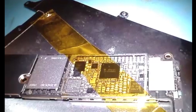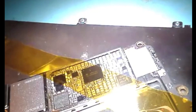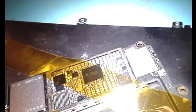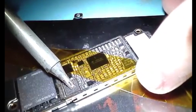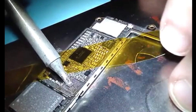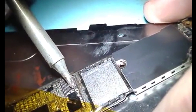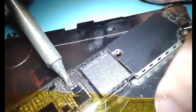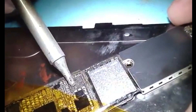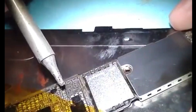Now it's very important while this board is still hot to come in here with a nice fat soldering iron. My soldering iron stays at about 427 to 428 degrees. And we're going to come in with a soldering iron with a big chisel tip on it while this board is still at 350 degrees. That way the ground plane is still going to be nice and hot, and the remaining solder we can take off very quickly and actually pull no pads when we're doing this. While I'm doing this, I actually check C12 — if C12 comes off while you're soldering on it, that's usually your indication that that was your issue to begin with.